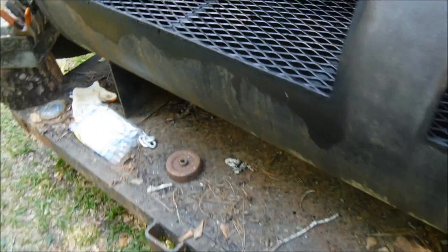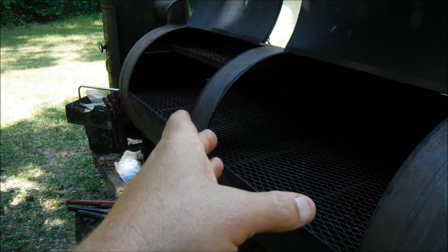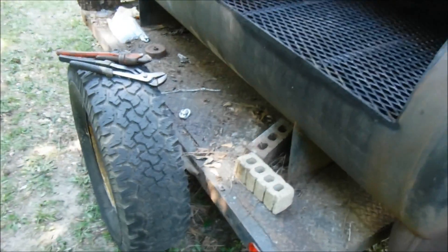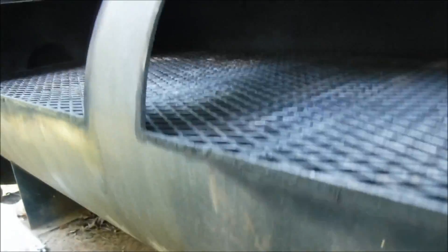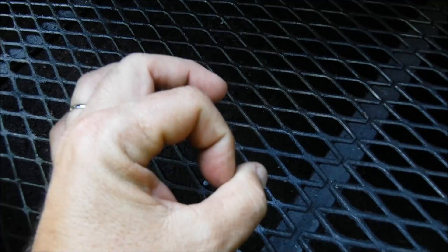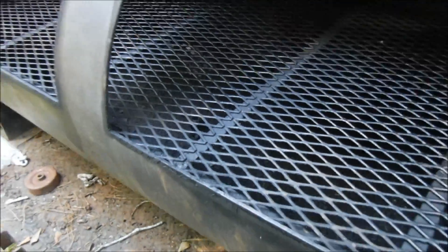But before I did that, let's back up a little bit. What I did is I took the supports, cut the supports off, rolled them 180 degrees, and welded them back on. If you look down here, this is where all the gauges and valves and everything are, and that pipe right there is a drain pipe. Then I came in and plugged all the holes — draining all the holes. I cut a little piece of metal, put it on there, and welded them up so there's only one drain plug with that pipe. So I can put a tray underneath the trailer with a brick in it to hold the tray down, and all the juice just drains into that tray. Then after the cookout, I pick the tray up and go on our merry way.